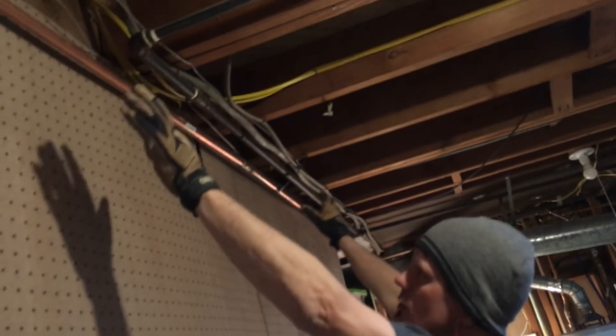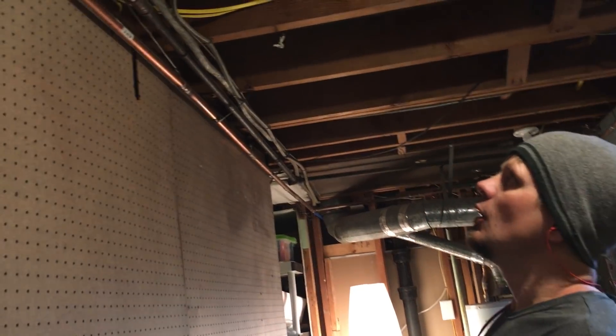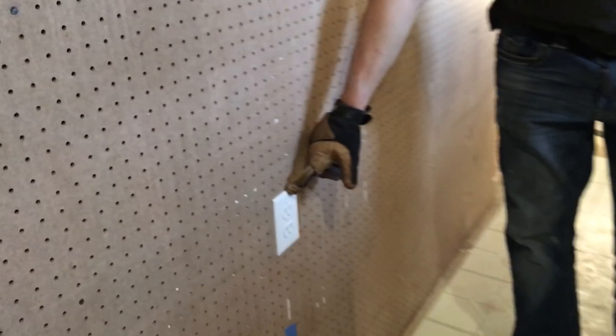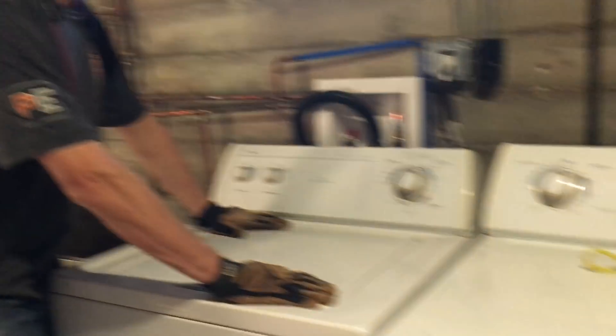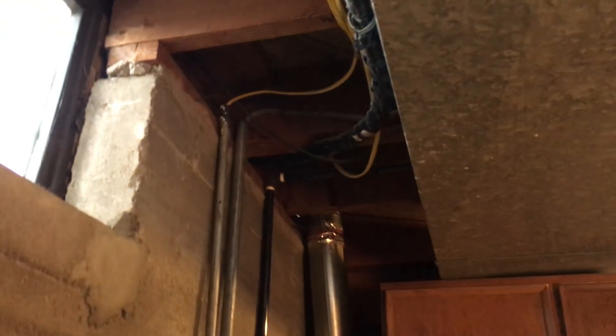Coming down here, as you can see this whole wall had the kitchen with the stairs, so that's a little difficult when you're putting boxes in the wall. She asked me to put in another plug and not take off the board, so this will be AFCI/GFCI protected. I remind you — I do not have to AFCI anything in an unfinished area per NEC article 210.12. Pay attention to part B though if you're in a dormitory versus part A when you're in an unfinished laundry room area.